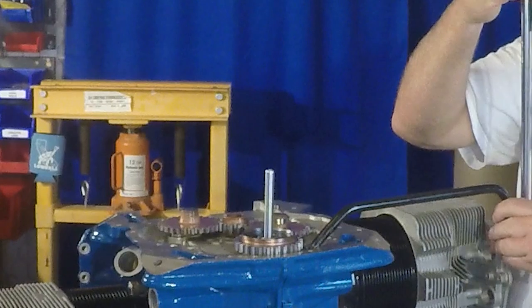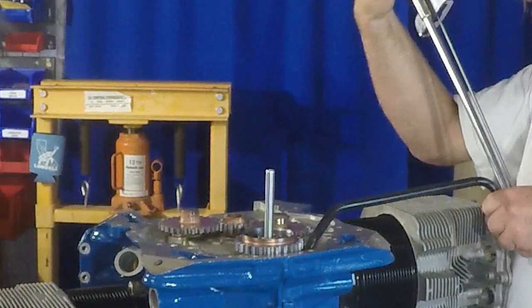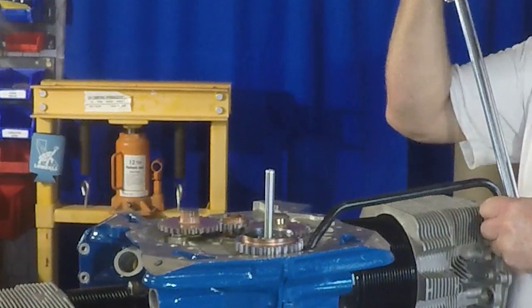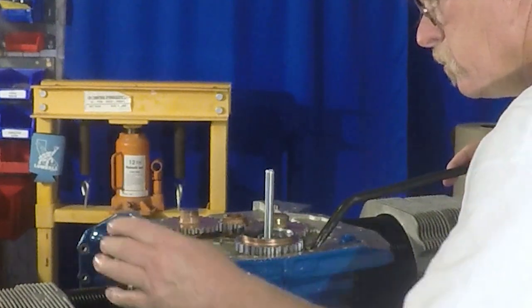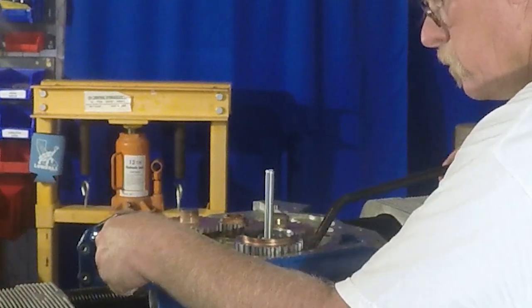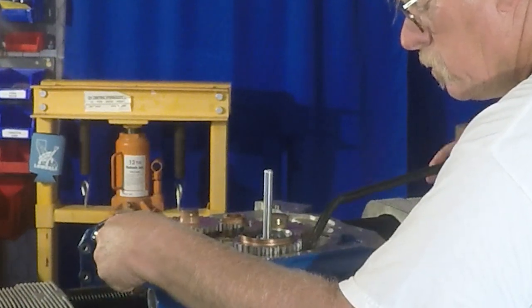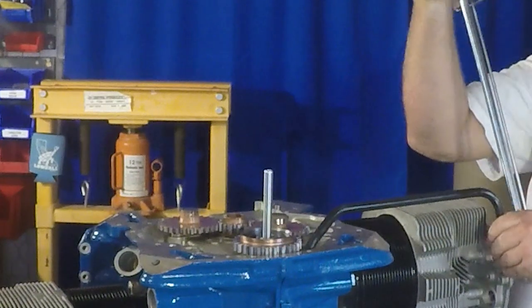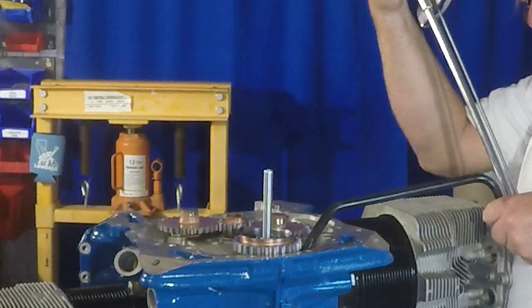Just go slow, and then, as I said, I'm just making sure that I've got my true torque, and I'm not clunking into the casting of the crankcase. So real important there. When we get done with this, this doesn't get a cotter key. There is a drilled boss in that area of the crankcase, and this will get safety wire.